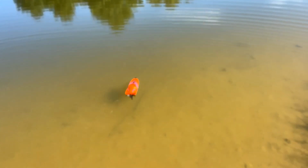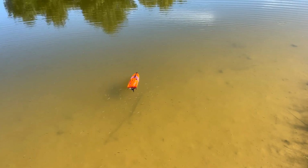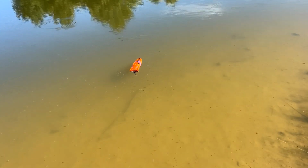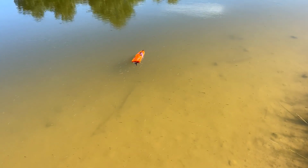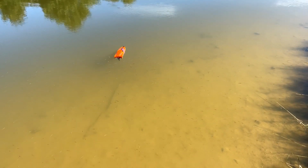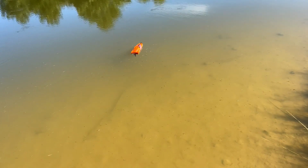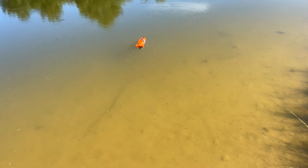The Liperior LIPO battery just ran about 7 minutes and 50 seconds before it died. What was interesting is that these lithium-ion batteries, they would start beeping, which is the low voltage warning, a minute or two before the batteries would die. We'll look at this recording now and see exactly what time they start beeping versus when they die. But the Liperior died very quickly once it hit that low voltage. So the last little bit of voltage just dumps out of it.